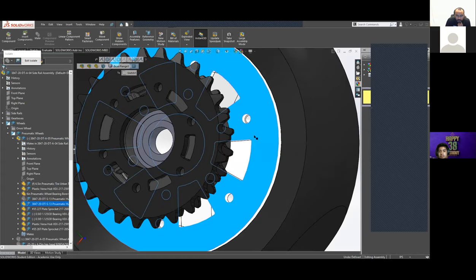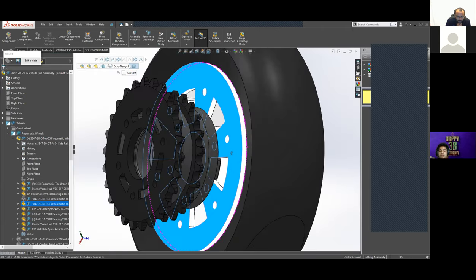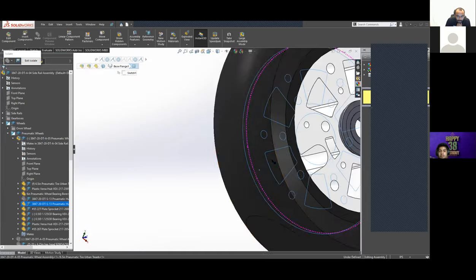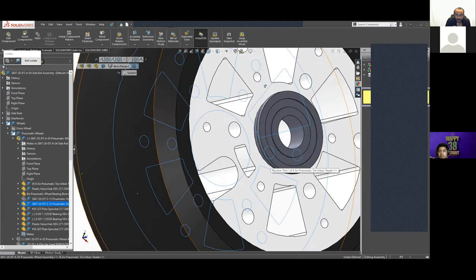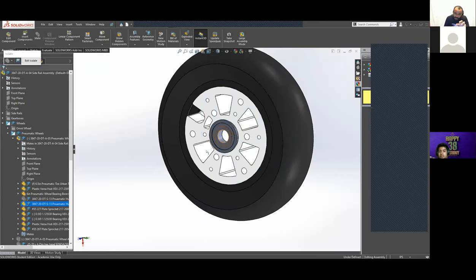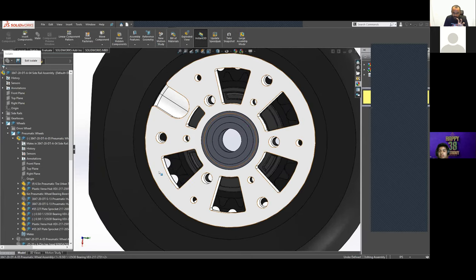so that when the wheel tries to expand outwards, it doesn't actually make it out. We tried making the metal out of polycarb at one point, but they started to break. So we made sheet metal just to be sure for the real ones. All the pressure is right at the edge of those flanges where the tire bead is being held in, and the polycarb wanted to flex a little bit as you increased the inflation pressure.